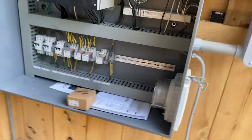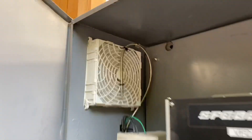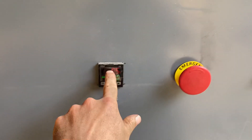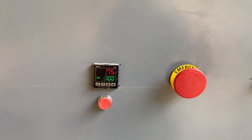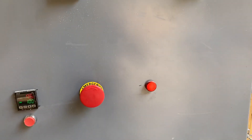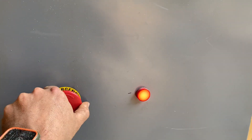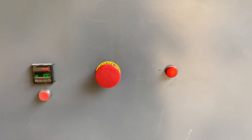There's a switch here, intake fan which is filtered, outlet, and temperature probe. If the cabinet goes over 100 degrees — which is what the variable frequency drive is rated for — it will automatically shut down all of the controls, same as if you hit the emergency stop, except it won't activate the braking relays, because you don't want the additional heat if you're already over temperature.